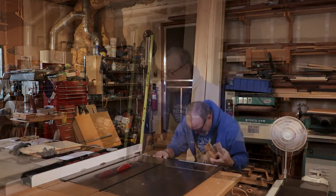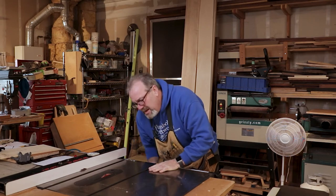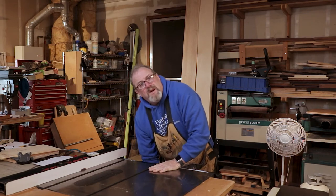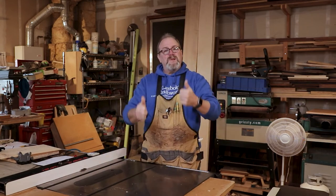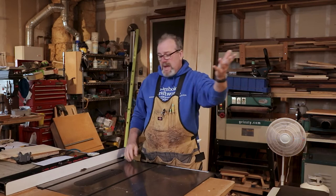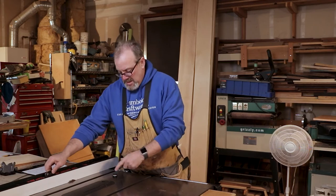Look down here too — and there we go. Another tip for you: when your table saw is not in use, put the blade all the way down so somebody doesn't come across and have their hand over it and slice themselves open. Two tip Tuesday! And there you go — so that's my table saw tools and where I keep them. You keep them within arm's distance so you don't have to leave the saw, don't have to go looking around.